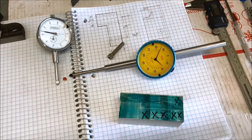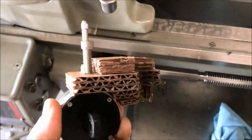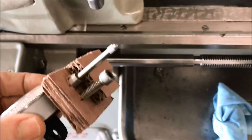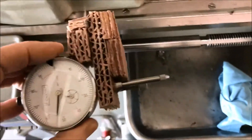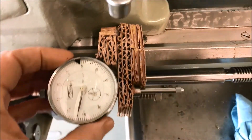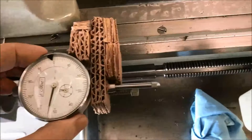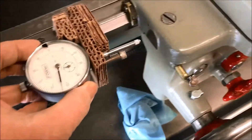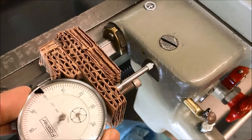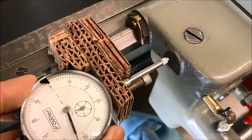Here's the cardboard mockup. We've got a stop screw which you can remove if you're not using it, and this is the standard one-inch micrometer indicator. The idea is it'll clamp onto the ways like that — I can get way back in here if necessary and of course move anywhere along. We're lining up on the saddle; you've got a factory milled surface here for the indicator or stop block, and both of them should make contact on that same milled surface.